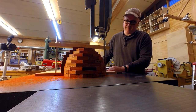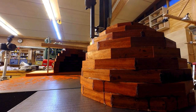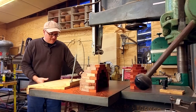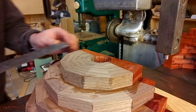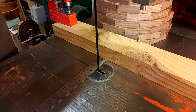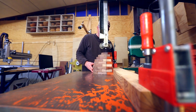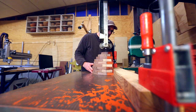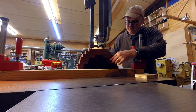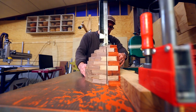But the cut itself was really easy. I needed to sand the cut surfaces and wasn't sure how straight the blade would be, so I wasn't sure how much extra to leave. For the first cut I used my little sled for the bandsaw. For the second cut I could just use a fence on the bandsaw because I had a flat surface to cut against. My goal was to get two halves with none of the other wood on them — one completely walnut and one completely padauk, with the mixed section in the piece I cut out.